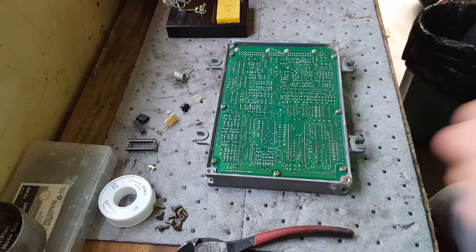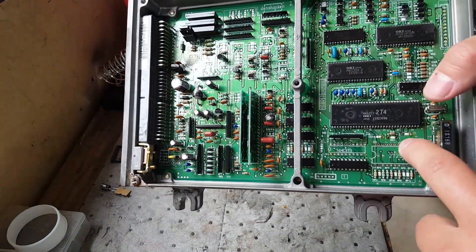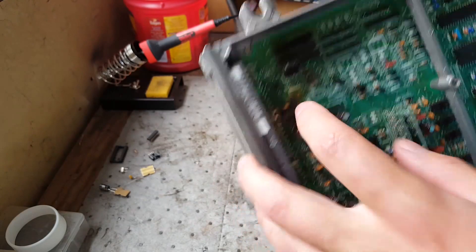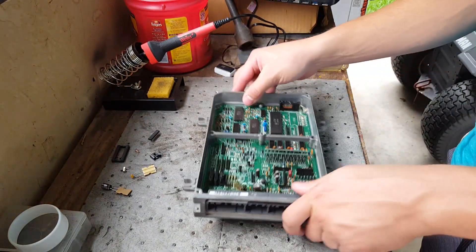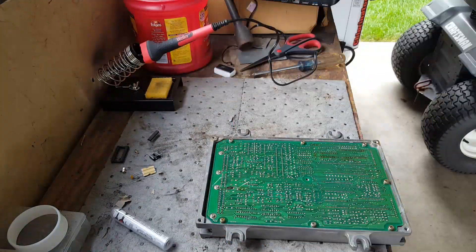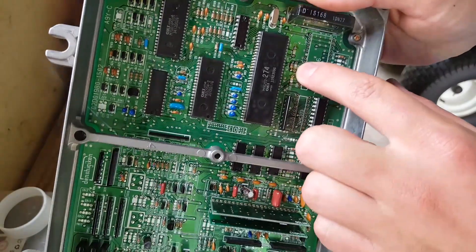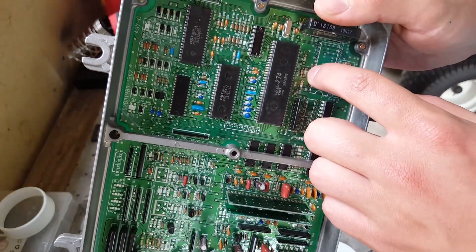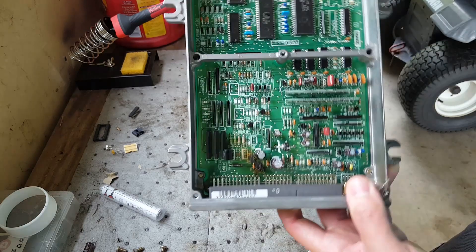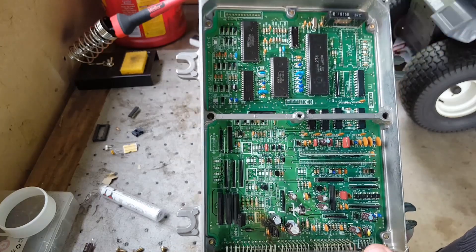This is actually going to take quite some time, so I'm going to go ahead and just desolder this and then show you when I'm done. Alright, I desoldered all of this — this here and some stuff over here and here. I also took out this capacitor right here. I'm going to go ahead and solder everything back in. I realized I didn't actually have to desolder R52 right here. Some ECUs have an R54 right here that this little resistor goes to — I thought it had to go into the R52 spot since it was left blank, but it turns out you just leave that one blank and don't use this resistor if you have a P75.